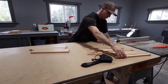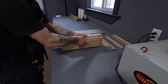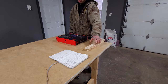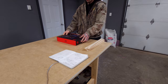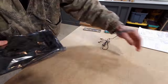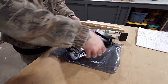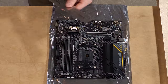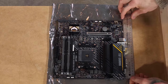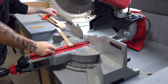I have a lot of cross-cutting to do, so that new 80-tooth blade is going to make a big difference. Now that I have all the wood broken down into smaller pieces, I can bring out the motherboard to grab some dimensions from. I'll start by identifying where the anchor points are on the motherboard and the overall footprint — it was 9 inches and 9 sixteenths by the exact same, so a perfect square. With that information, I can now start making cuts for the motherboard tray.